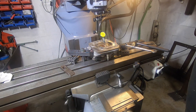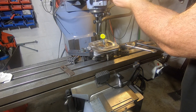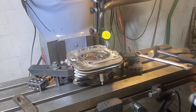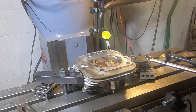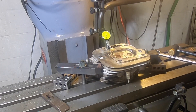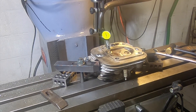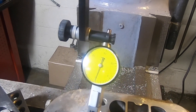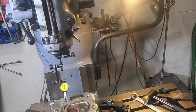Lining up to cut the second head. I want to check this for flatness — make sure my fixture is okay and understand how much needs to come off the top. Let's see what this low spot looks like. Not too bad either — maybe almost one thou low there. Coming across the low spot now, you see that, right about one thou low, and then she comes back again. So we'll take two thousandths off of this one as well. Should be a real similar cut — we'll run it at the same feed rate and should have the same results.